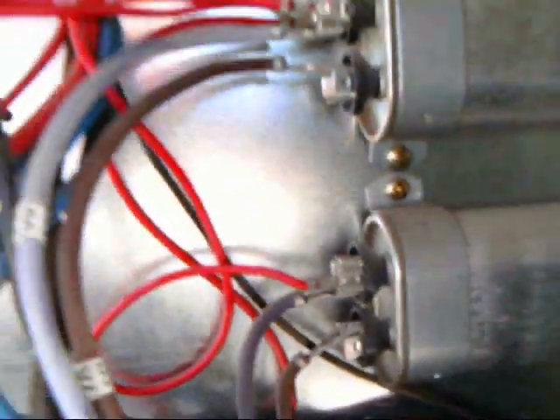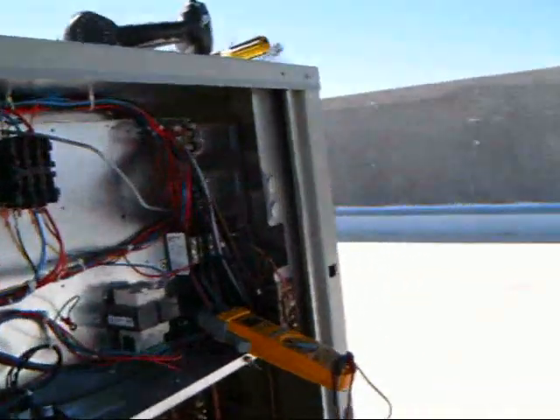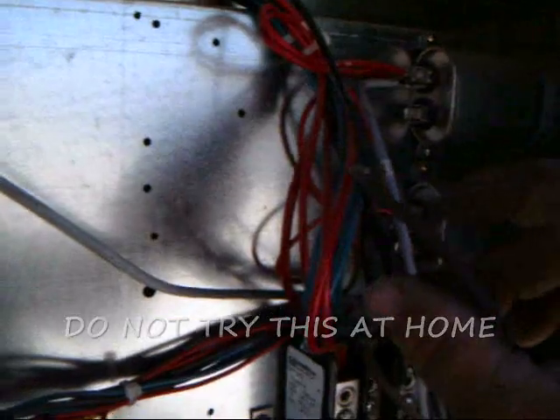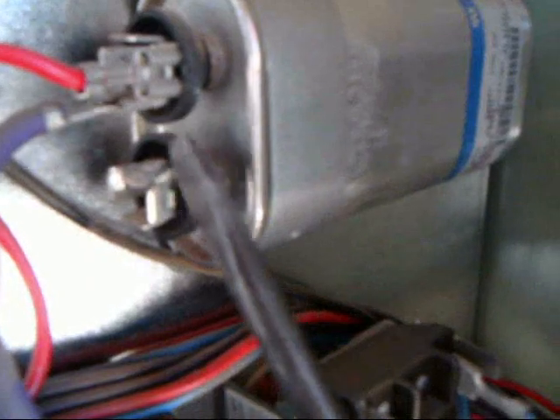That's not showing a schematic. I've got these two brown wires loose so I can pull them off - that's without shocking myself. Let's see if I can purposely leave a charge on the run caps and see what they look like. Turn the power off. Let's see if we have anything left in there. This is the only way you'd get enough voltage left in a run cap to get shocked. The second one.